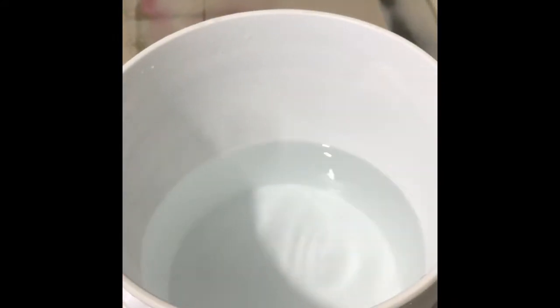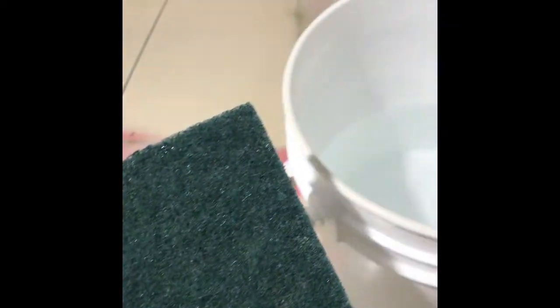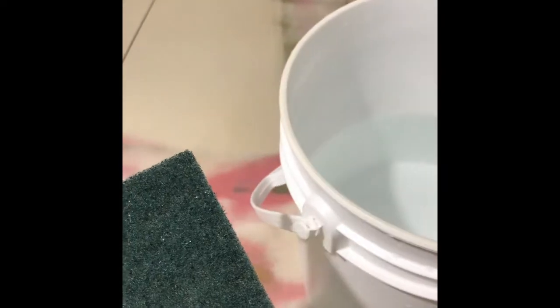Here is another example of how Amine Blush looks on another piece of sandpaper. This one was 120 grit, but as you can see it's fairly clogged and you're really unable to use it after maybe 30 seconds of use — so it's a real problem. I'll be using just some warm water in a bucket and a scotch-brite scouring pad, just dipping it in the water and applying it to the whole surface.